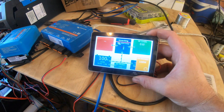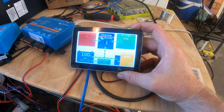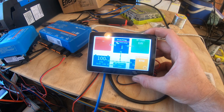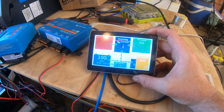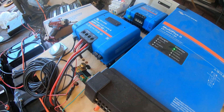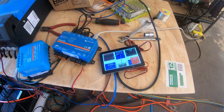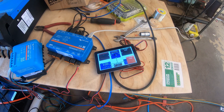The idea of putting them in 48-volt strings was to get some usable power out of them. 48 volts at 50 amps is reasonable — that's what maxes the inverter — and we've got two strings, so we should be able to double that without damaging them. It also means we can charge at 40 amps, and we have a 45-amp charge controller. So this seems like a pretty reasonably priced set of batteries, provided it does what it says.